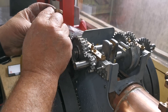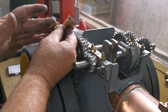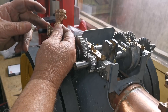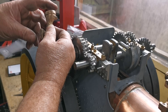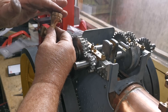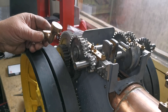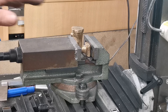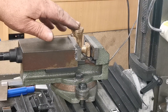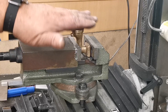I've already checked for squareness on this and as you can see it's a little bit higher on the backside there, so I'll just skim that first then we'll go from there. As you can see I've got that set up in the milling machine — I'm just going to take some light cuts just to flatten that off.